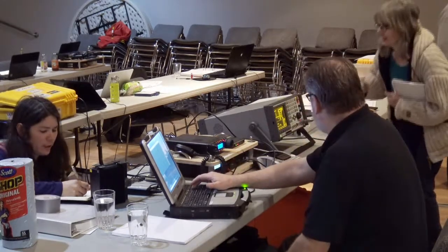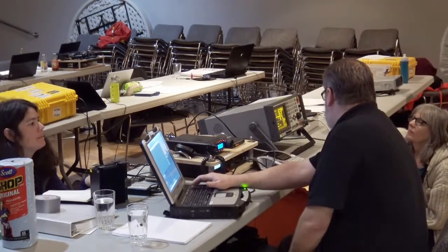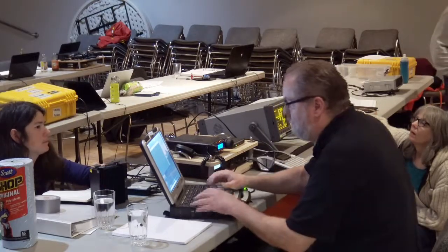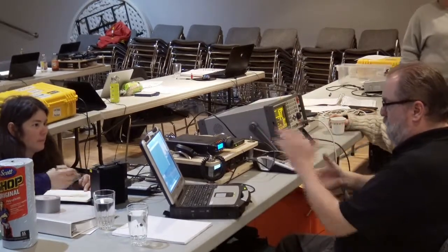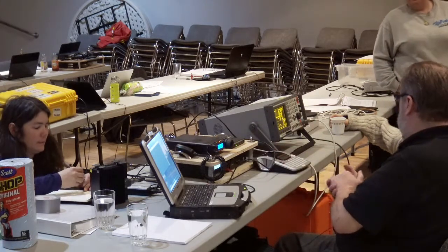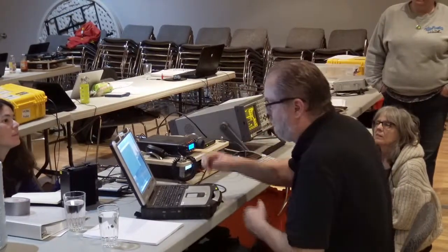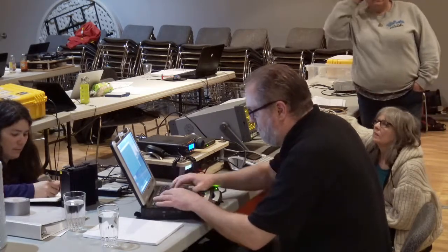Yes, 2.15. Okay, so this particular radio is 2.15 kilohertz deviation. Basically what I did is the same thing as I did in the last one. The radio's on the same frequency. I brought up the calibration. I put in the command T, which gets both dual tone. I looked at the deviation here, and it was at 2.15, and I increased it to 2.75, and then I got out of the program, and then I'll type the XMIT level.